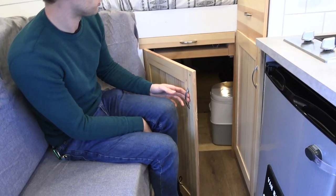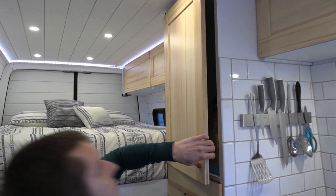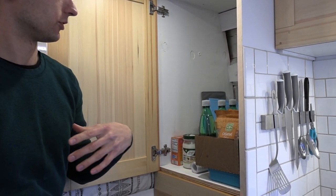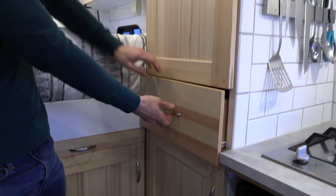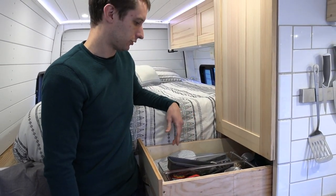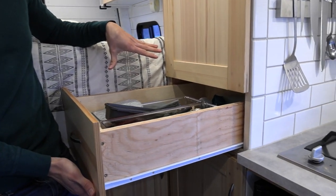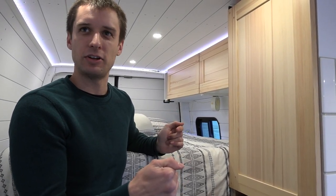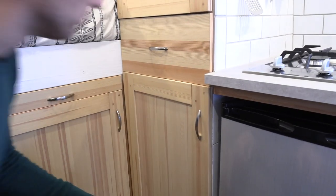This is our pass-through access to the garage. This tall cabinet — the top cabinet is actually going to be food storage. We've got another childproof lock up here because it's eventually going to have shelves with cans in it — we didn't want anything heavy to be able to push the door open. Down here is a silverware and cooking implement drawer that I custom made, just using some 22-inch drawer slides. It's about four-and-a-half to five inches deep by about 22 inches long. This was actually a bug that turned into a feature — I built it about an eighth of an inch too narrow, so it's really sticky, which means it just won't open on its own when we're driving.